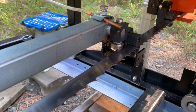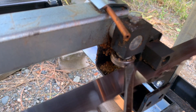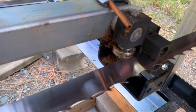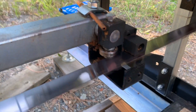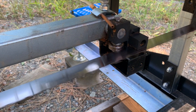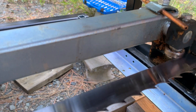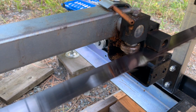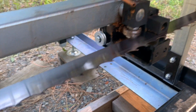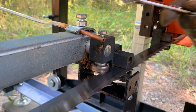See, it's not really turning right now. I'm going to use my pointer instead of my finger — so that's the bearing, and you see how it's barely bearing. These guide the blade as it's turning. We'll give it just a touch — it's actually moving a little, so we'll let it find its own happy spot. Still turning. See how it's just touching barely — we'll call that one good enough. That's the adjustment right here.